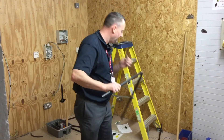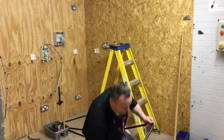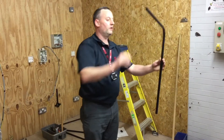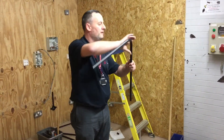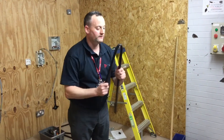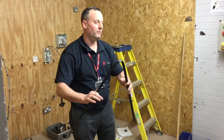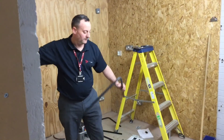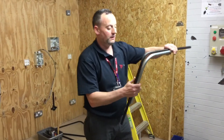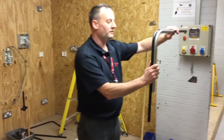We said before: if it goes beyond 90 degrees, the spring must be reinserted. So if we're in a position where we've gone beyond 90 degrees, the spring must be reinserted around the corner — because otherwise the conduit itself will just collapse without the spring in it. We can push it out but not in, and we're trying to create a bending radius that looks correct.